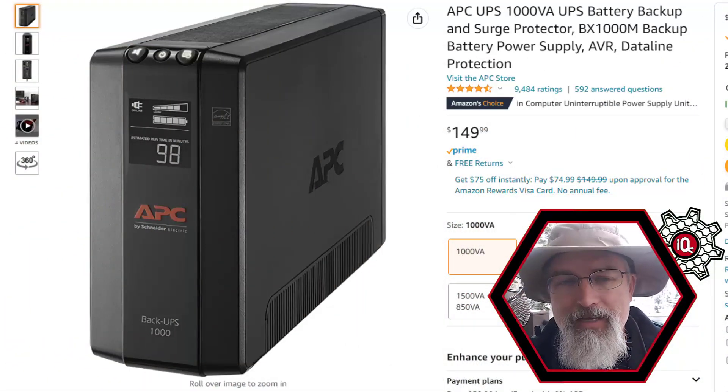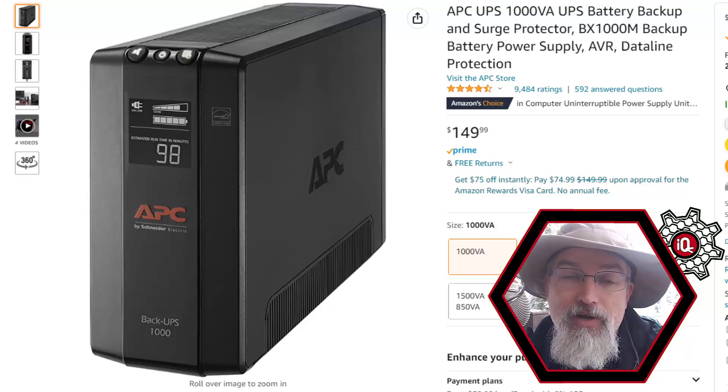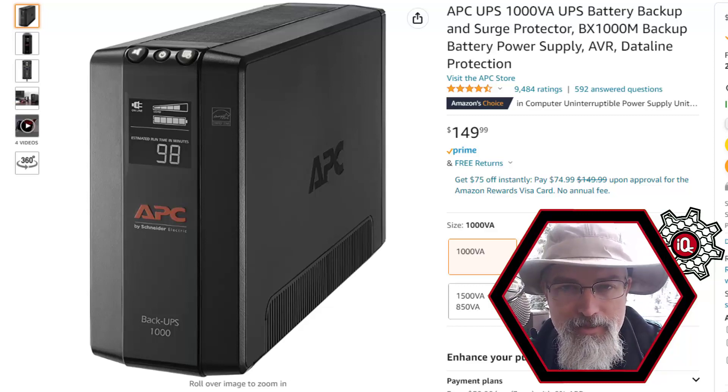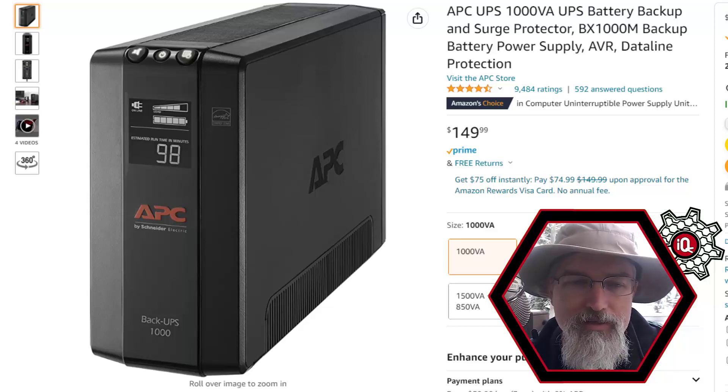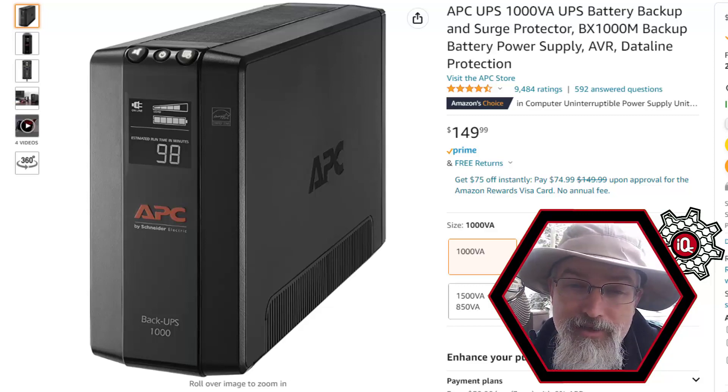The solution — which I probably should have had a long time ago — is basically a battery backup. If you're in the computer industry, you're very familiar with uninterruptible power supplies. You plug all your equipment into one of these, and there's a battery inside. It acts as a surge protector — it cleans the power up. So in the case of voltage spikes, it may not rely on the battery but would protect from surges and even out the power. And if you lose power entirely, this can run the machines for a certain period of time. The display shows how many minutes it'll run based on current usage.